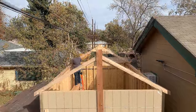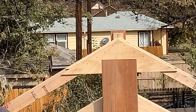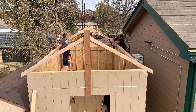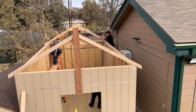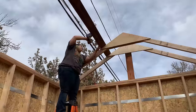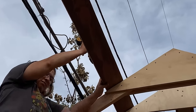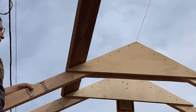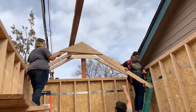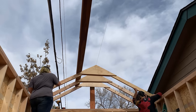We're ready to rotate the next truss up into place and get it lined up with the center line. We do have it lined up directly on our string line, and the next truss along with all remaining trusses will have a plywood gusset on both sides. Once we've established the center line, we'll toenail this truss down to the top plate with just one toenail on each side. Maya is putting a temporary board — a long 2x6 that extends the length of the shed — putting one screw into the top of each truss to hold them rigidly in place so we can safely walk on the plywood when we install the roof.